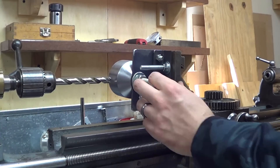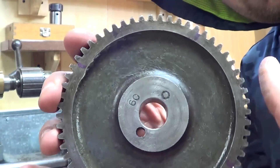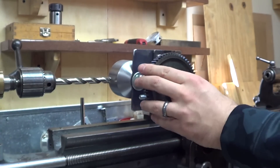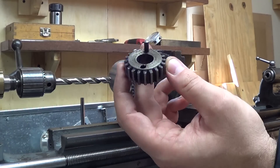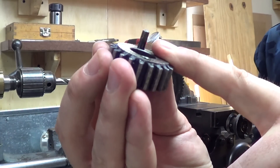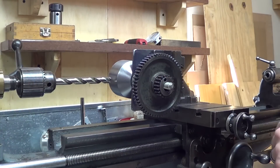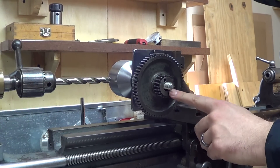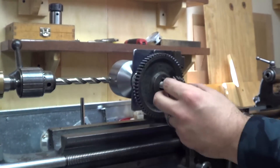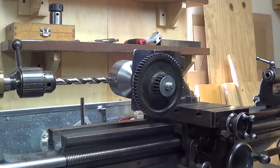Here I'm just adding a bolt and a couple washers for my gear. I chose a 60-tooth gear because I wanted to drill six holes, so that's easy math — six goes into 60 ten times, so I'd be able to incrementally divide. This small gear serves absolutely no purpose; it's there because these gears have a stud, and to protect that stud from the washer and the nut, I just had to put that on there.